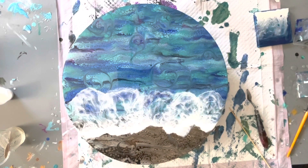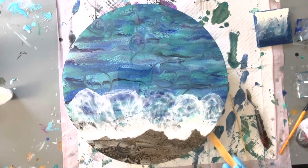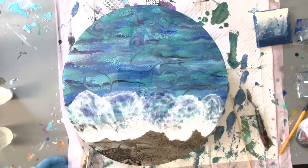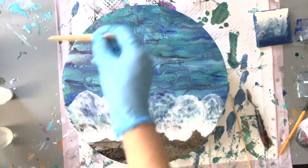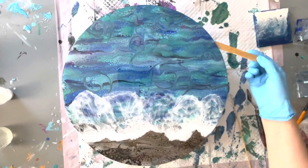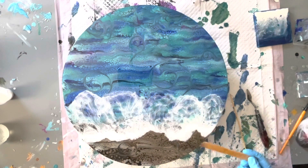I just heated that again to get rid of any last bubbles, and now I'll cover this and let it set up overnight. I'll come back once it's set to see what the final result looks like. And don't forget — almost forgot — to wipe your drips from underneath around the edge, otherwise they will keep drawing resin off the top. Just get your paddle pop stick and scrape underneath to wipe all those little drips off; it also makes it easier to remove your tape later if there's not too much resin underneath.